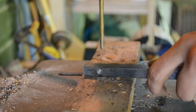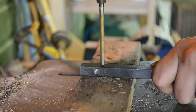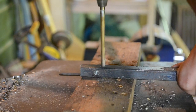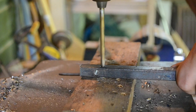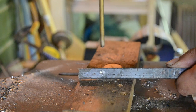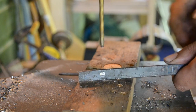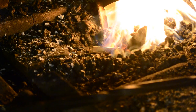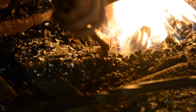This has blunted the drill bit. Here we are back on the unhardened section. Again, it's unable to go further than a little divot. The drill bit is toast. It is such a bizarre myth because it's so easy to disprove. Iron with any amount of carbon, however small, can be hardened to some degree. Any iron that has been in a forge has at least some carbon in it.